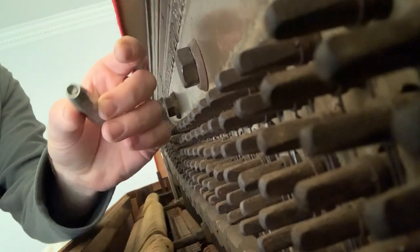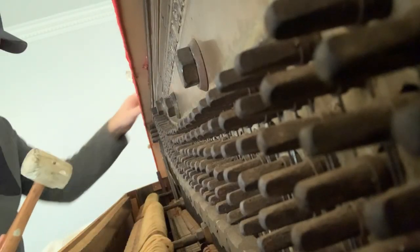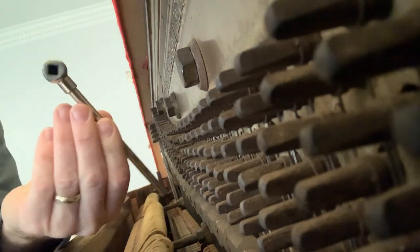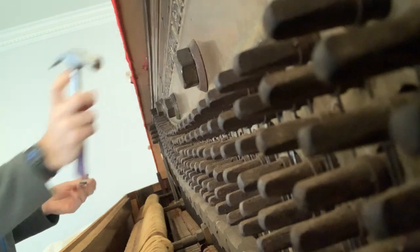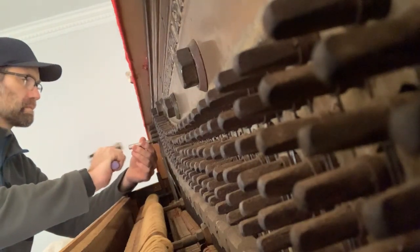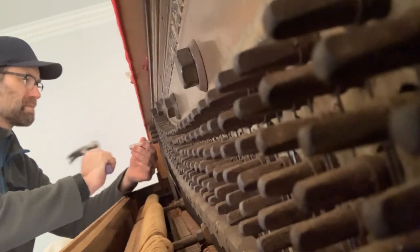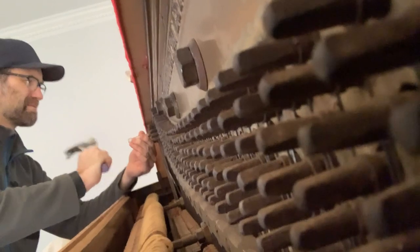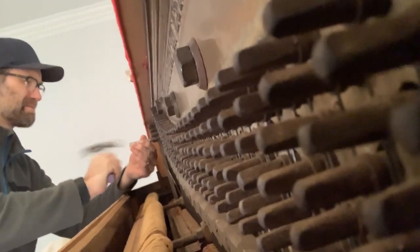You're going to need a hammer and a tuning pin punch — this is a tuning pin punch — and I've got just a basic hammer. I have this other tool also; that tool actually causes the pin not to turn. Either way, I usually just use the punch. I just tap, just a little bit.